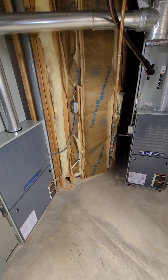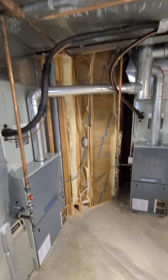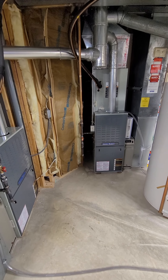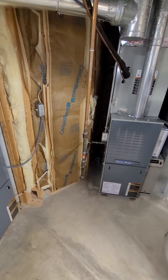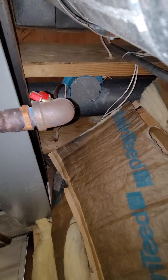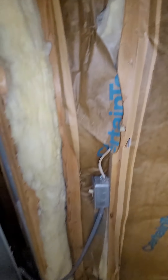I know there are several different things here, but I don't know which direction she wants to go. I'll have to get with you to verify which direction she chooses. If we do the water softener as well, here's the drain right in front. There's no outlet that I see right here, but there is a box up there — maybe we can drop a line down to it to plug in, or just make that an outlet and plug the softener into it.